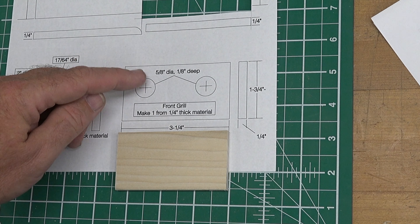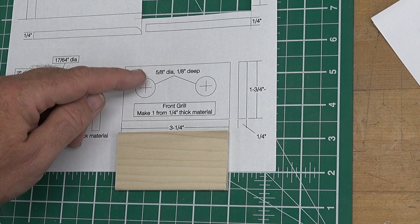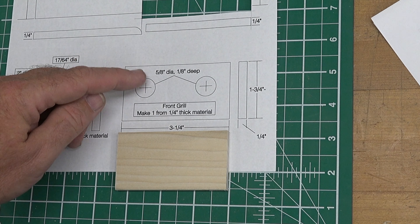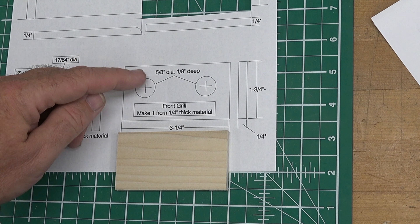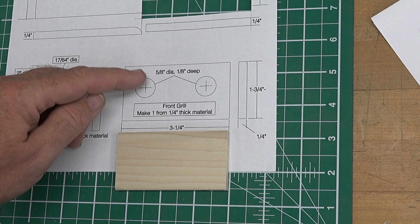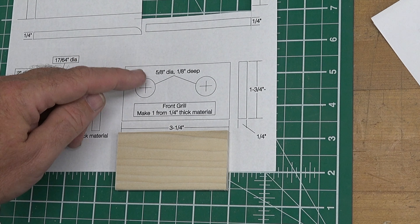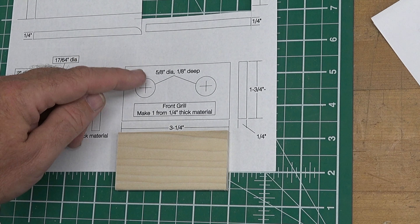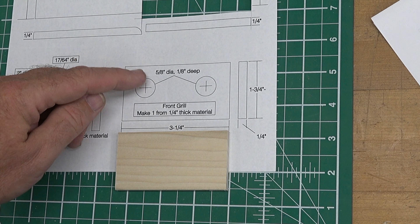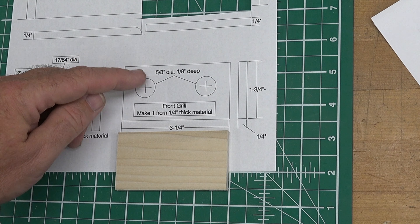For the sake of assembly, keeping square edges, and having everything made properly, it was better to cut the pieces at the table saw so that everything fits together properly. I'm going to adhere these patterns to quarter-inch MDF, cut them out to make templates, mark out the pieces, and cut them accordingly. Those three pieces are pretty straightforward — with the templates it worked out really well for tracing them.